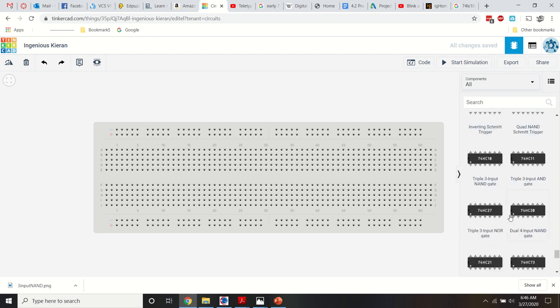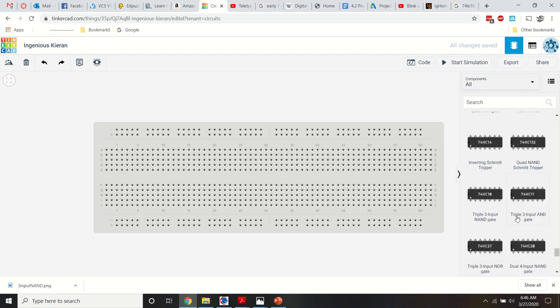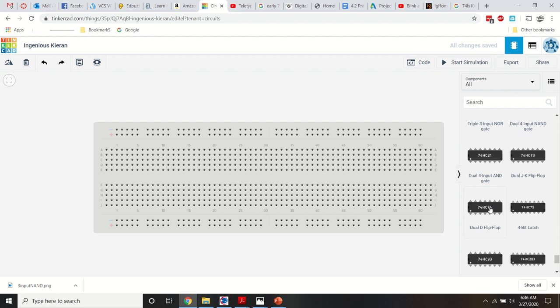I am going to need my 7474. We're going to do the dual D flip-flop. So you want to put it here so it straddles that break there. I'm going to put another one next to it because eventually we're going to do a 3-bit flip-flop counter.